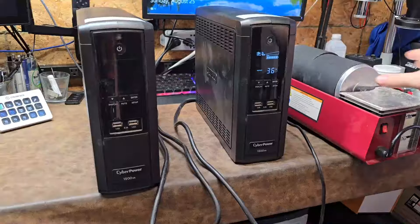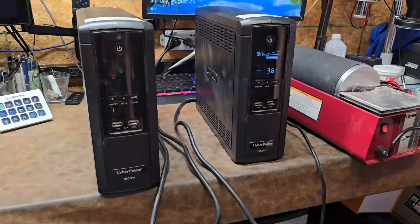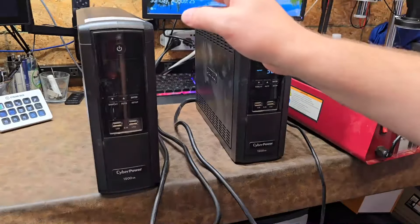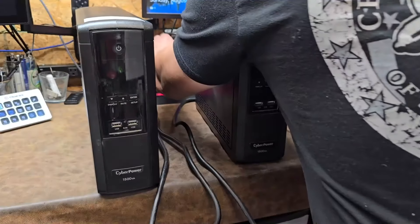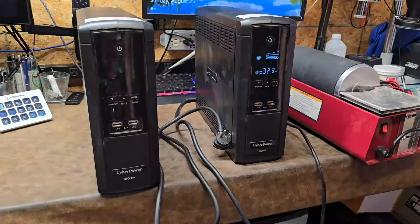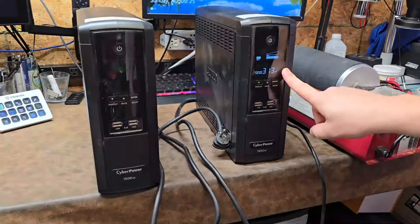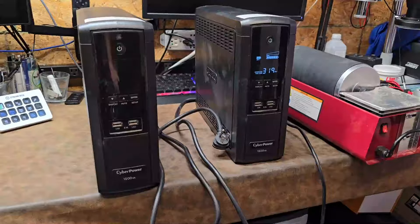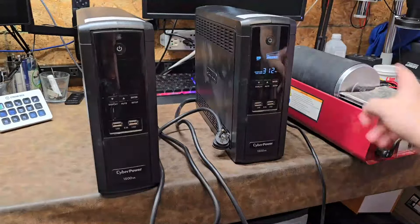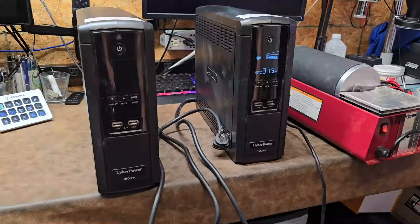You can see it is running and doing its thing. However, it has almost no load on this unit. The way to test a UPS is to give it a considerable load, then unplug it from AC mains — it should click over and give you a timer showing how much time you have left before it fails. If the time starts dropping exponentially, your batteries are not in good shape. Right now it's reading 317 minutes — there's no way it'll run 300 minutes — but if I get even 100 minutes at this low amperage, I'm pretty satisfied. It looks fairly stable, having charged for a month.